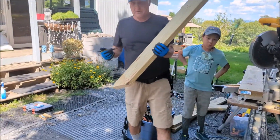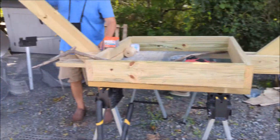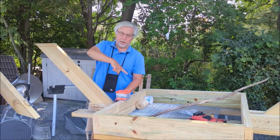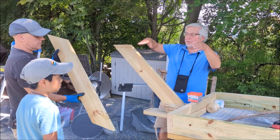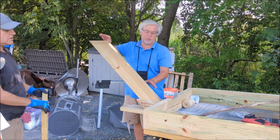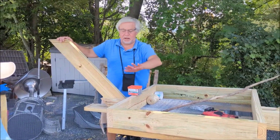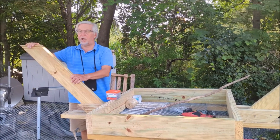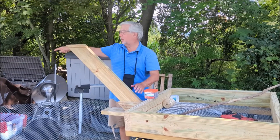Let's go back over here to this piece and look at this. We said: how long does this piece need to be? We took the square, went straight up, then straight across, and asked how high do we want the bird to be. We figured out that we wanted the bird to be about 24 inches — two feet — up above the nest, because if they build the nest big like they sometimes do, we wanted the perch to still be higher up. Based on that, we determined the length of this piece.